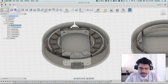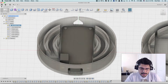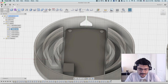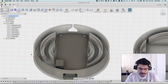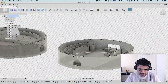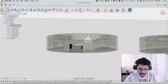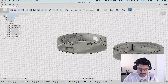I actually modeled the two components: the NeoPixel ring and the BLE feather board. You can see how it is being mounted — there's this sort of elevator standoff thing, and a bottom with a channel so that the wires can pass through, and it just snaps into this little cavity area. There's a little slit so the wires can pass through over the headphone area. And there's a big hole here for the micro USB port — I always make a big hole because connectors for micro USB can be a little bit bigger, so I always accommodate for those.